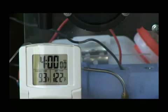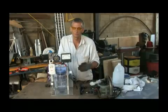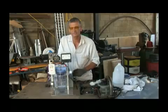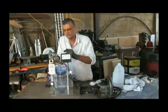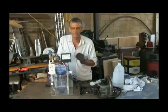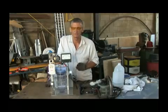If I was to turn on the power full right now with the variac, you'd see the reaction but only for a short bit. It would pop the breaker either on the variac or the transformer or the breaker on the cell — one of them would go. That's why we have to heat the water to the right temperature to give it the right resistance to make this experiment work.